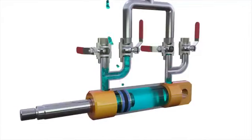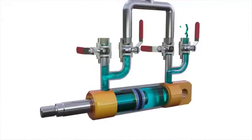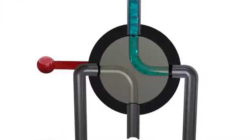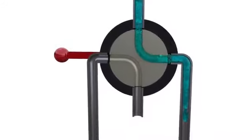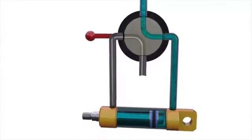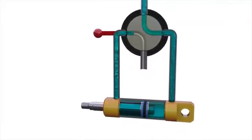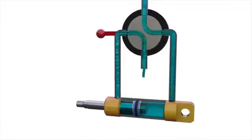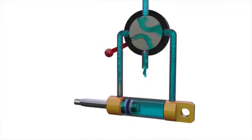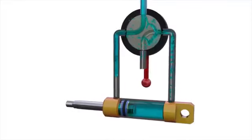It's definitely inconvenient to switch several handles simultaneously, so let's try to combine the valves into one element. Let's make 2 fitting channels in the shutoff and control element. Now, in one position, the directional control valve will connect the piston cavity with the pump, and the rod cavity with the tank, while in the other position, it will connect the piston cavity with the tank and the rod cavity with the pump. Hence, we've got a directional control valve with a rotary spool.